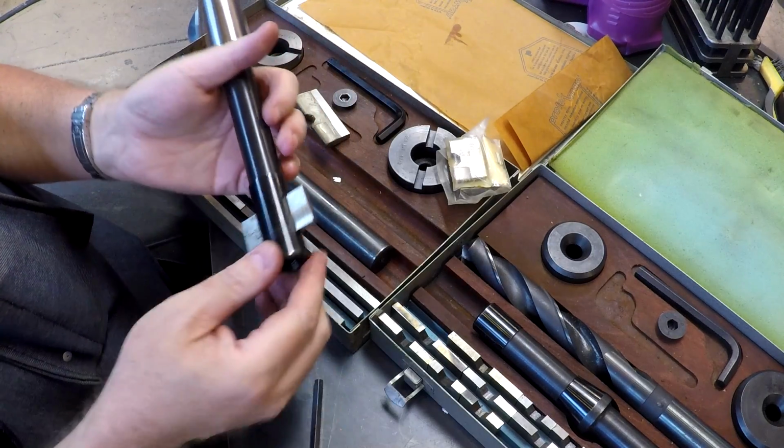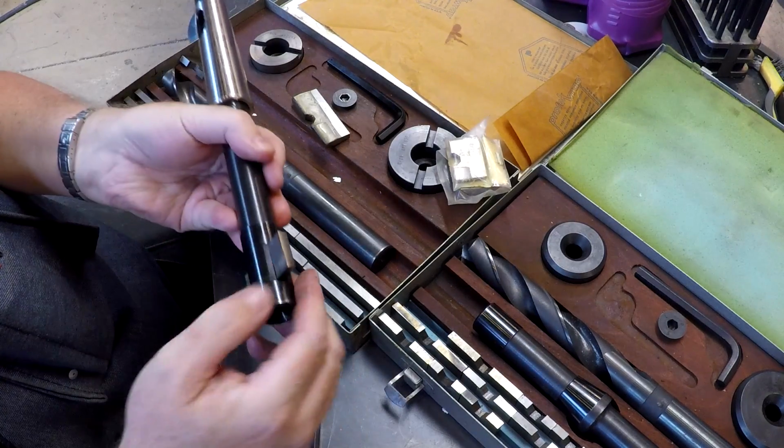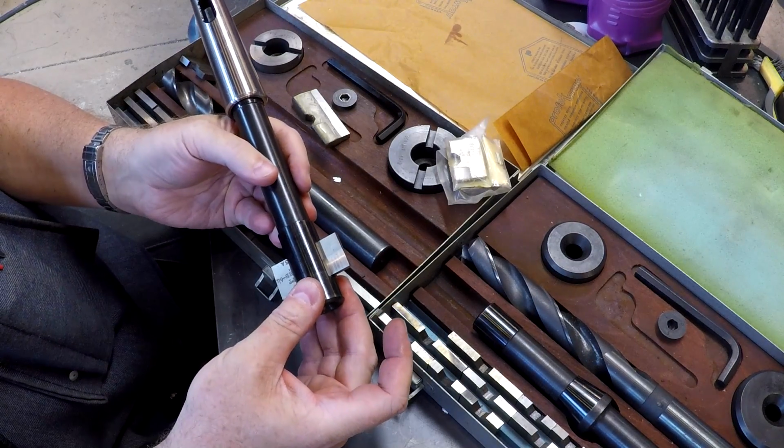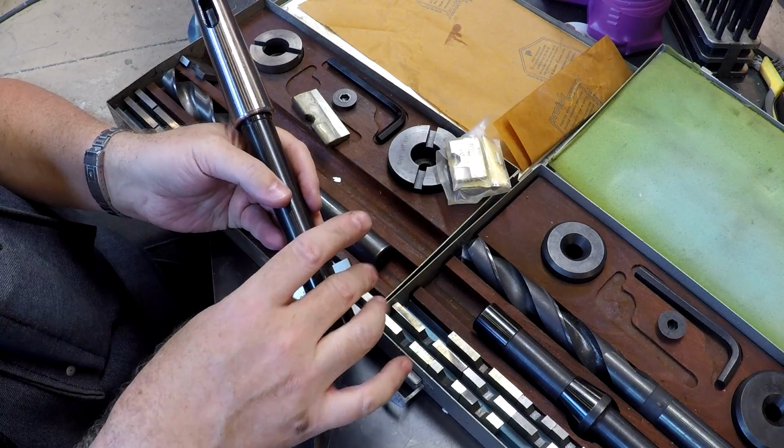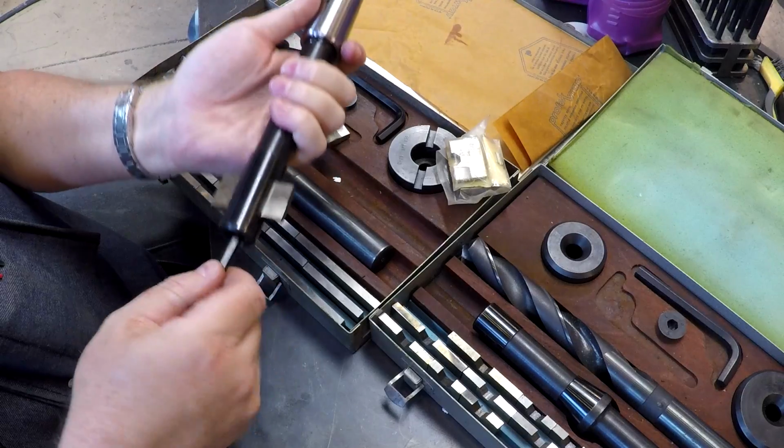You're going to tighten that down, then you're going to drill from 1 inch to 2 inch. Cutting edge on both sides there. Again, you're going to pilot off the 1 inch, then you're going to drill to 2 inch. And then, okay, if you want to go to 2 inch, you're done. But let's say you needed something bigger than 2 inch.